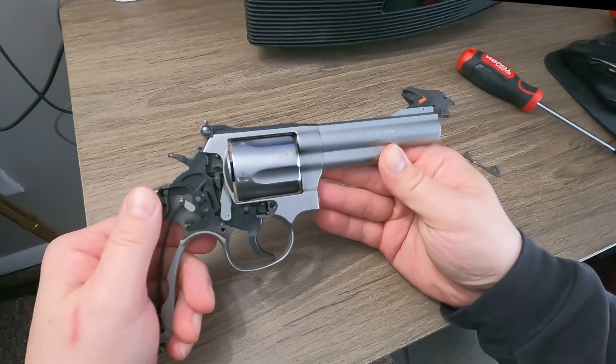If I keep my finger fully pulled to the rear, the hammer impacts the transfer bar, the transfer bar impacts the firing pin. If I let off the trigger, the transfer bar falls out of the way because it's connected to the trigger mechanism. Both are really solid designs — I'd say the Smith and Wesson is a little bit more complicated in some respects but it's kind of a double safety. There are definitely some advantages when it comes to a hammer block system versus a transfer bar. Basically, why I like Smith and Wesson better is I find them to be more reliable.